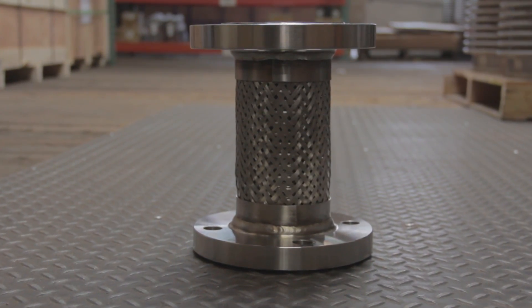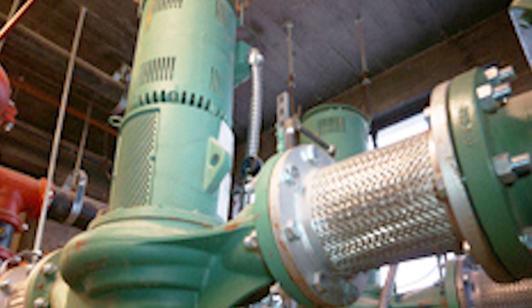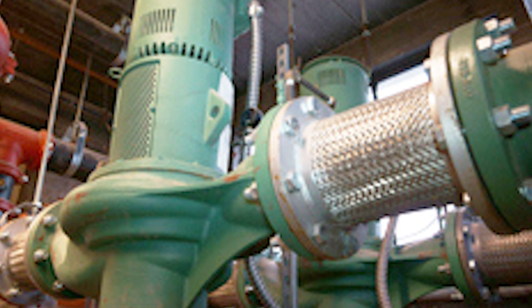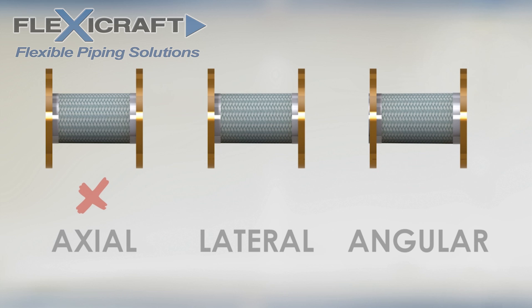The braid essentially acts like tie rods. And because these are most often used on pumps and other equipment as flexible connectors, eliminating the thrust load on the equipment nozzles — which act as anchors — is often critical to pump performance. Although they cannot absorb thermal growth compression, they can move for lateral offset and absorb vibration well. Flexible pipe connectors are usually either braided metal types or spherical rubber joints with tie rods as previously discussed.